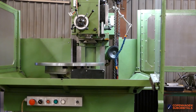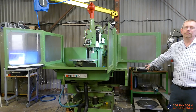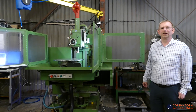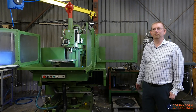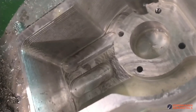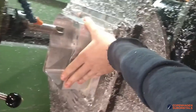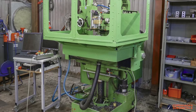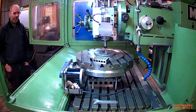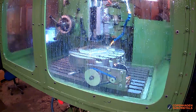Originally the main machine came without this protection cage around the table. It had an operator panel mounted on the side that we removed, simply because the control in the operator panel was too old — the system is a mid-80s design, so it couldn't do G-code, and it definitely could not do three-dimensional G-code as we wanted. So we took that away and added the safety cage around the working area. We have also added a controllable round table to it, based on parts we had in the workshop, and added some motor control and other things ourselves.